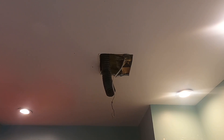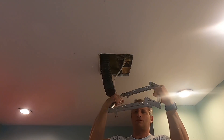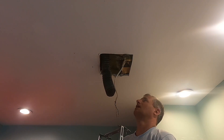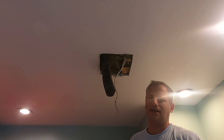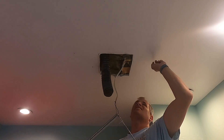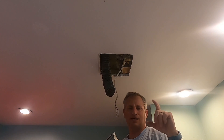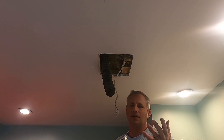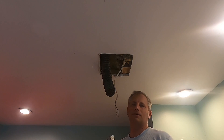The next step is installing this bracket. The bracket goes like this — it turns — and it specifically says 'up,' so you want to make sure it's up. I'm going to slide this in. You can only screw one side; one side is fine. I'm going to screw this side in. On the other side it's going to be sitting on the drywall, so it's like an old work box clip basically. Once the two screws are in and I put in the exhaust fan, it doesn't go anywhere. So let me start working on that.